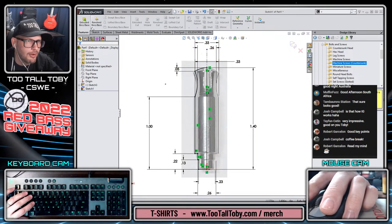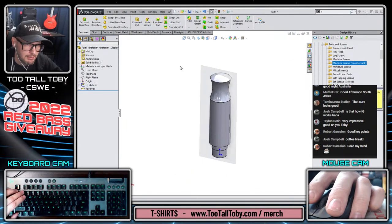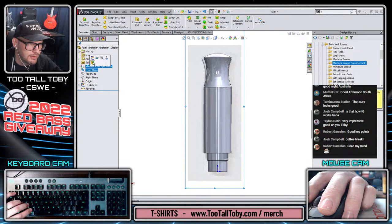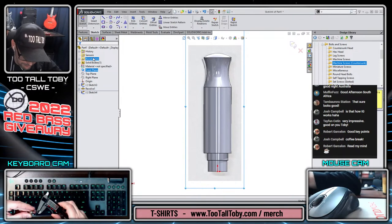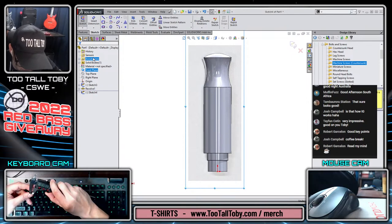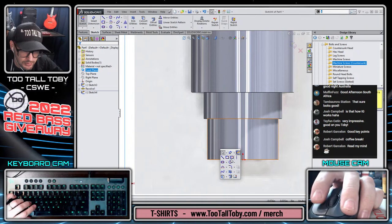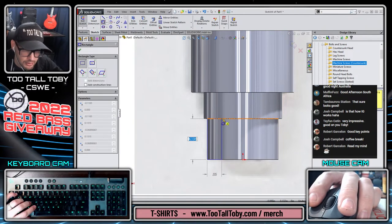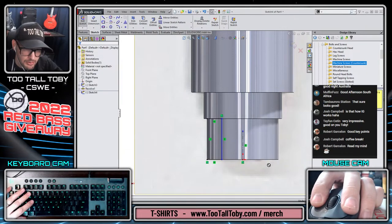Features, revolve. And we'll revolve that peg around like so. And then we can go front plane, begin a sketch, orient our view. And we can say that at the very bottom of that thing, there are two flat spots. And those two flat spots are at 0.1925. So we can go to this corner here, drag this up to here, create a center line, mirror that geometry